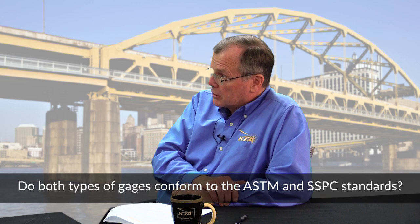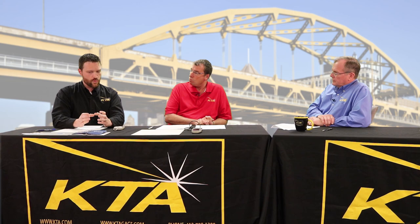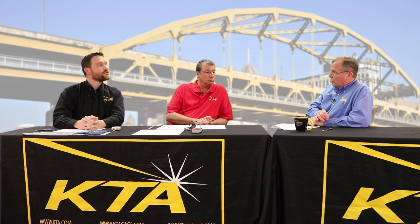John, based on what Bill talked about in the standards, do both the single reading probe and the scanning probe meet those standards? Both the standard applies because it's dealing mainly with frequency and use of the instruments for measurement. The biggest difference is that the scanning probe takes a lot more readings over a larger area compared to the single reading probe we're more accustomed to. Right now the standards don't address the scanning probe — they do address the single probe — and we'll talk a little more about that in a moment.